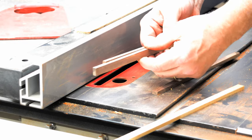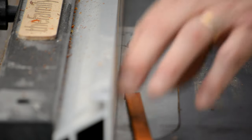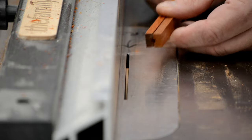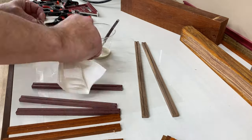The next step is to notch in a center core to accept the ink tube. You can make enough room for the eighth-inch wide ink tube by centering your cuts on the table saw, or you could also use a router table and an eighth-inch straight bit. I'm only taking a small sixteenth-of-an-inch deep centering cut that I'll finish out with a long drill bit later. When I put the two pieces together, that center cut hole will help guide the drill bit down the middle. I'll do this step for each pair of pen halves.